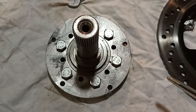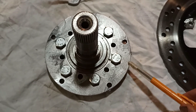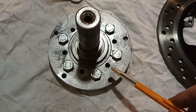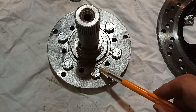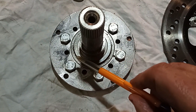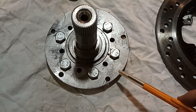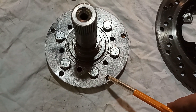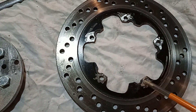The output flange is complete. The output adapter is fitted — it's got more holes in it than Boris Johnson's party excuses. The inner ring of six holes attaches the CV, the outer ring of six holes and six bolts attaches the flange to the output shaft, and the final ring of five bolts fixes the inboard disc brake.